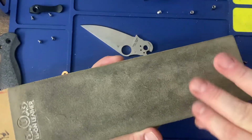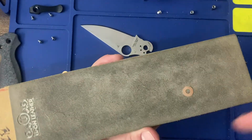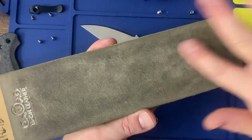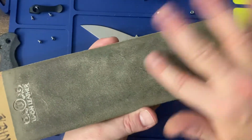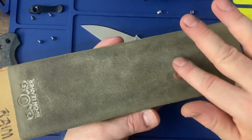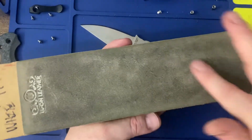I'm smoothing out the top by trying to get all the patina, any oxidation, stuff that's just a couple of microns deep. Well, guess what? This is a 1 micron strop. A 5 or 6,000 is about, 6,000 is about what, a 4 micron? 2.5 micron, I should say. 4 micron, I believe, is about a 4,000. About a 2.5 micron for 6,000. That's pretty amazing. I think 1.5 micron is 8, and then 1 is like a 12. And then for some reason, half a micron is 50.